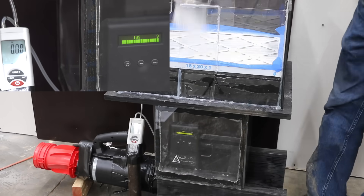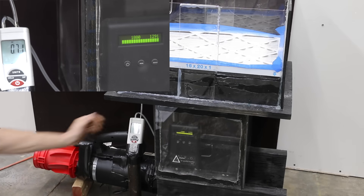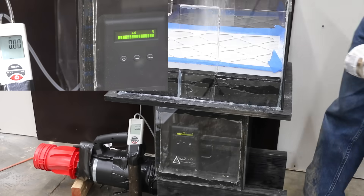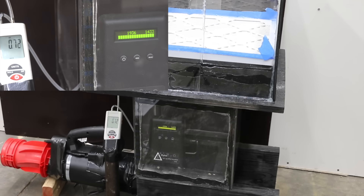The Aerostar did better than the True Blue at 6,100 large and 5,000 small particles, with a better static pressure of 0.74 — the best of the MERV-8 filters at that point. Nordic Pure did better than the Aerostar at 5,000 large and 4,100 small particles, and also had a slightly better static pressure of 0.73, the best of the MERV-8 filters.